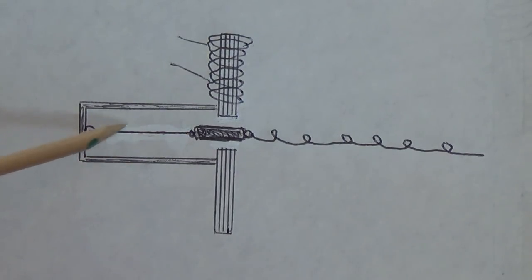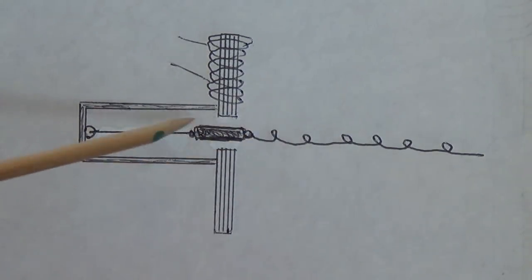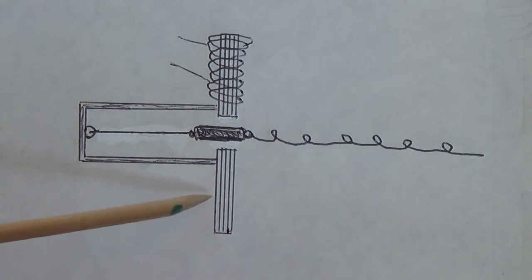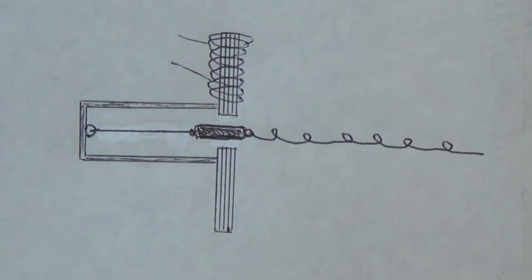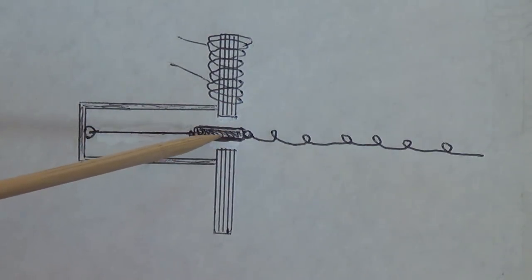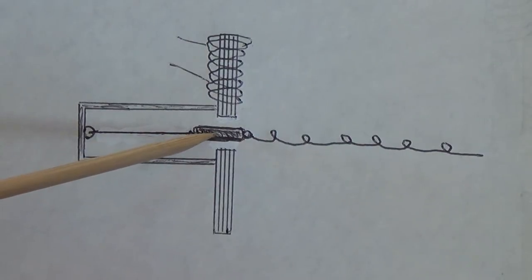That makes a lot more sense to me, because if it were a spring, I would think that these stronger springs out here would be able to pull the rod out of the range of the electromagnets. Therefore, a piece of steel wire here keeps it always centered between the magnetic poles. Secondly, the rod itself is magnetized. You can prove this to yourself very quickly — if you have a tank, touch it with a little piece of steel wire and the wire will stick to it. So it is a magnet. It is not a passive victim of a magnetic field. It is, in itself, a magnet.